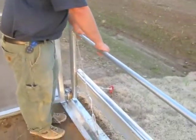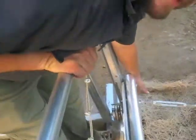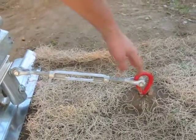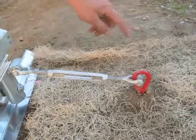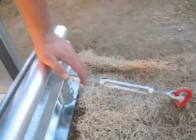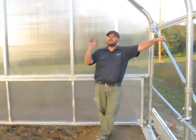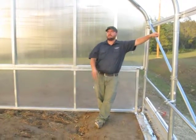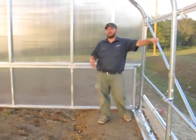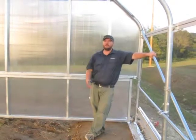Looking at the outside of the structure, we have a forged eye bolt coming out from the bottom of the hoop directly above the V-track roller, and then a yoke-to-yoke turnbuckle attaches to an earth auger — a twist-in earth auger 40 inches long screwed into the ground. This turnbuckle allows us to loosen or tension the anchor to the structure. There's an exterior anchor every 24 feet on these buildings. So we've talked about our sidewall corner braces, roof corner braces, ridge braces, cable X braces, collar ties and W truss, cable anchors, and exterior anchors. When they're all in, you've got a nice, strong, stable, movable structure.